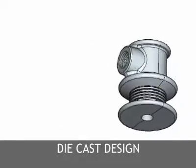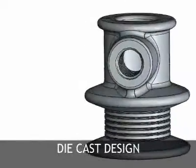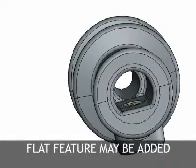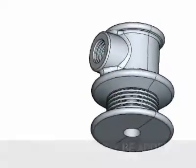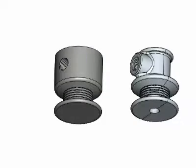The die cast design allows the V-shaped groove, shaft hole, and the set screw hole to be as cast, greatly reducing expensive machining. In addition, a flat can be cast in the shaft hole, allowing the die cast pulley to be quickly oriented onto the shaft flat, greatly reducing assembly time. Only one machining operation — tapping the as cast set screw hole — is required on the die cast pulley.